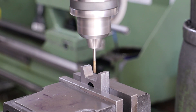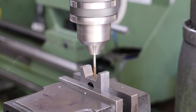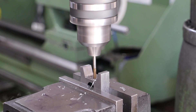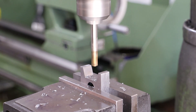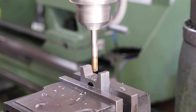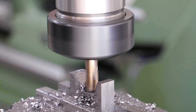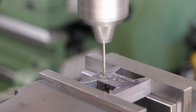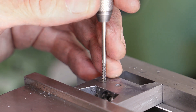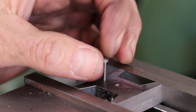To correctly position the stubs in the front face of each crosshead, a register hole is machined — first drilled, then opened out to 13/32 with a slot drill to a depth of 3mm, avoiding a near-mistake of going too wide for the 6.4mm connecting rod recess. Next, a hole is drilled and tapped for a securing pin for the drop arm, located centered front-to-back and 6.4mm from the bottom, at 4mm deep, going straight in with the plug tap.